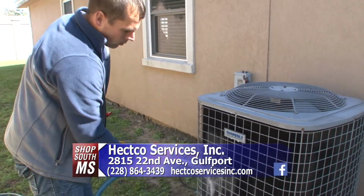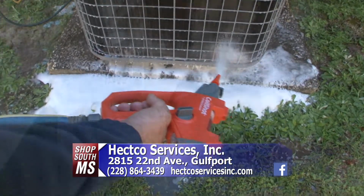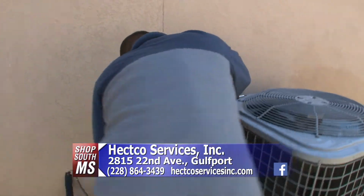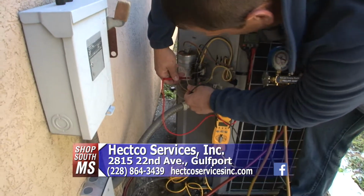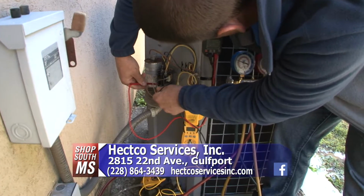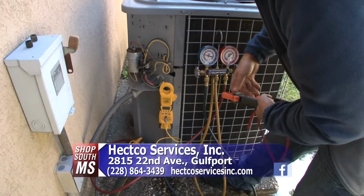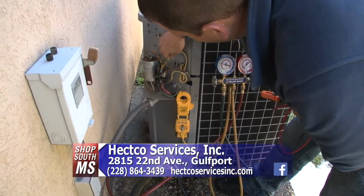And then, of course, we'll move on to checking out the electrical system. Yes, we'll go on to check out the electrical system, and we'll show you. So after we've washed it out, then you've got to start checking out the electrical system and everything. Right. It's very important to make sure that we're getting a good reading on our motors, your amp reading on the compressor. Make sure that the contactor is not pitted, is not making a false connection. We've got to make sure that all the connections are good and tight, making good connection to the capacitor. It'll cause shorts if you don't. Oh yes, indeed.